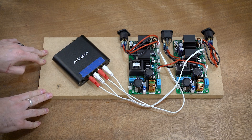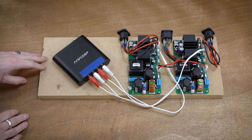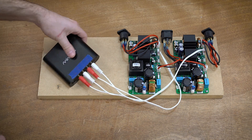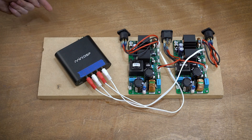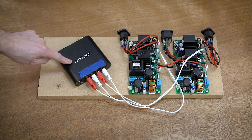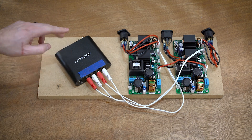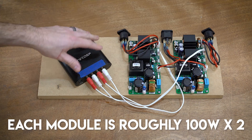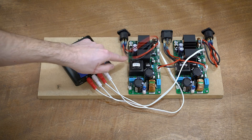Now let's talk about the electronics. Here is the current state of the controller amplifier board. The secret sauce to this kit is really in the DSP — it's in the signal processing on how it splits out the signal to the specific drivers and all of the filters that go on. That's all contained inside this miniDSP. This is a 2x4 HD — you've got an optical input as well as an analog input. So your signal will come in, all the magic happens, and then you have four outputs: two for the left and two for the right. Then they go into these two Bang & Olufsen IcePower 125 ASX2 amplifier modules. Each one is a stereo amplifier with a built-in power supply, class D, as you can tell from the size of these.